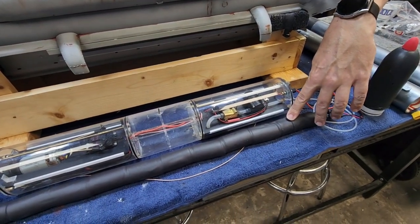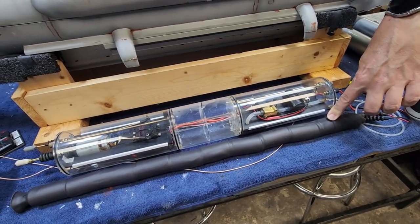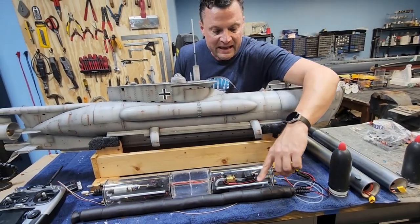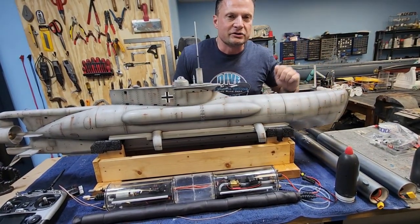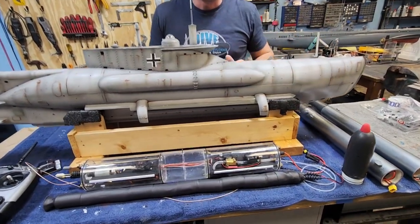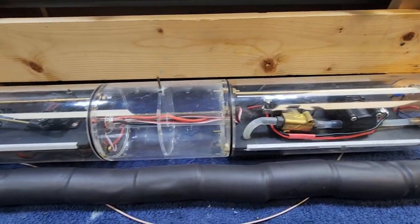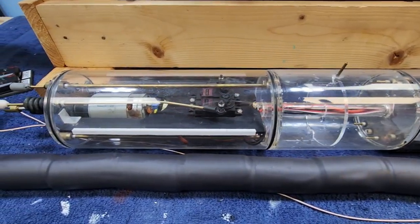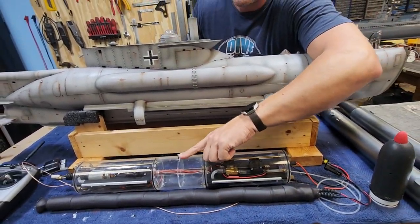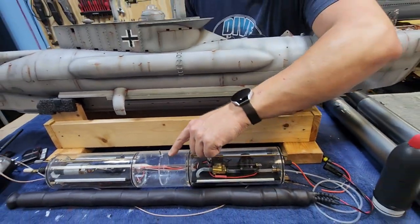Taking a look at the front, we've got a big heavy-duty nickel metal hydride 10 amp-hour battery pack operating at 12 volts. If you did not watch my video on the creation of this battery pack, I'll put a link to that in the description. This is what powers the entire model. This is an OTW 3.5-inch diameter watertight cylinder, single shaft, with the big motor option in it and a 6-inch tank. What is not typical for these OTW modules is what you see right here.